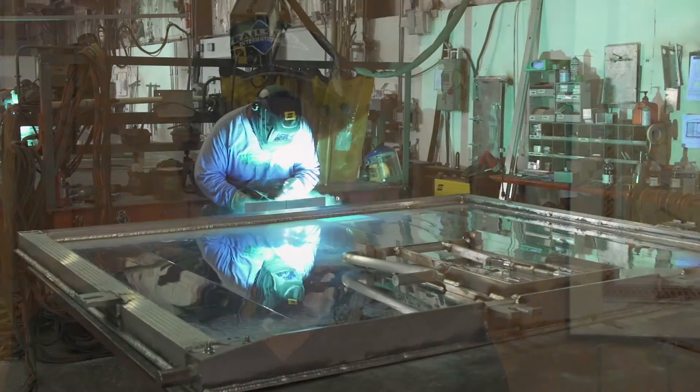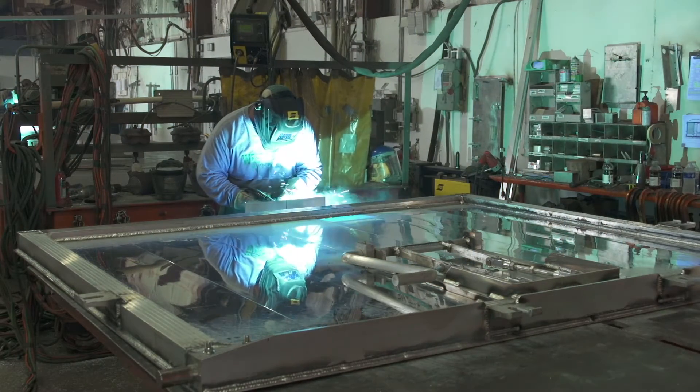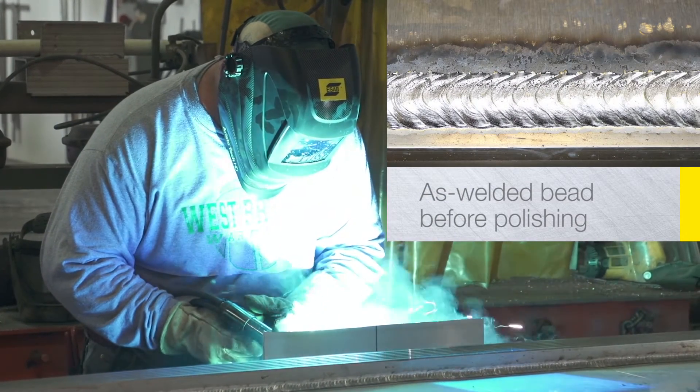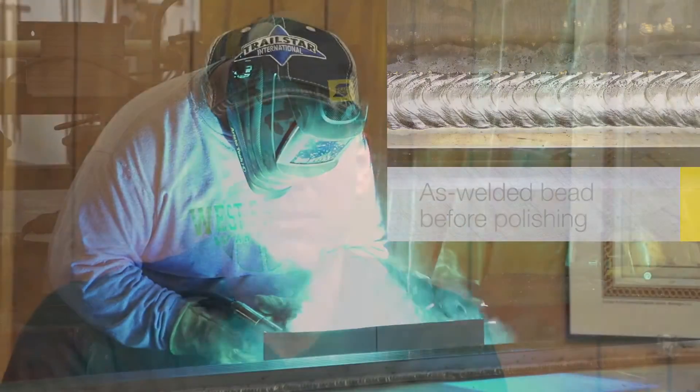The production reason is the pulse. To keep the spatter down — we're using it to build our tailgates — we don't want that spatter all over it that I've got to try to get off to put stickers and reflective tape on, so we went with that pulse.